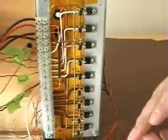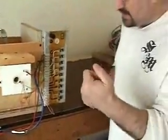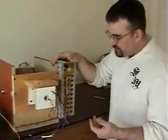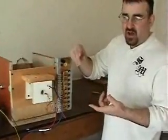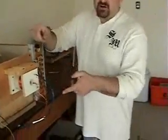What we're trying to do — and I've seen it on a scope, though I don't have a scope here — when we have the wheel running, we're getting voltage spikes well over 200 volts on the scope. They're very short, very sharp, and you get lots of them. Big, nasty spikes which, by the way, will fry solid-state components very easily, so you want to be careful. What we're doing with the switching circuits is trying to capture those large spikes — John Bedini calls them radiant spikes, radiant energy — and send them to our batteries.